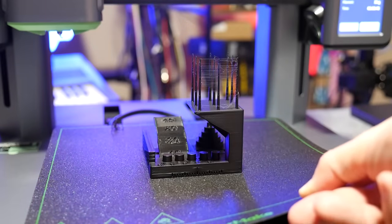This is the Maker's Muse clearance castle, and when it was printed, initially the tower and portcullis were actually stuck — just in tiny little areas at the top and bottom where the solid infill had slightly bulged out. I think that's because linear advance wasn't enabled in their slicer, and at the higher speeds there was a little bit of bulging in the corners. I did then enable it for future prints, which results in slightly more rounded corners but better clearances. The drawbridge looks great with the bridging. The tower can indeed twist, and the portcullis did free up quite easily.